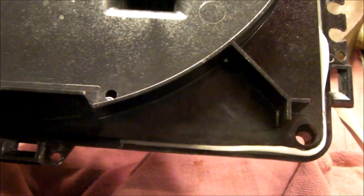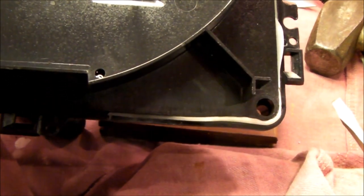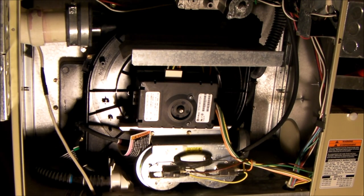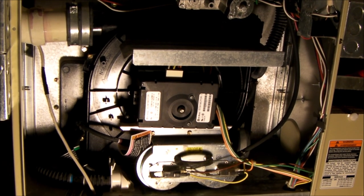If I had to do it over again, I would spend a little more money than a couple of dollars for a ball bearing — maybe spend extra for a USA-made bearing as opposed to a Chinese bearing, and the fit would have been a little bit better. Got everything back together again, so let's fire it up. I don't really want to run it too long because my RTV is still wet, but let's see what the new bearing sounds like. Oh, that's pretty quiet — much quieter than it was. If this helped you, please help me with a subscription. Thanks for watching and good luck with your troubleshooting and repairs.